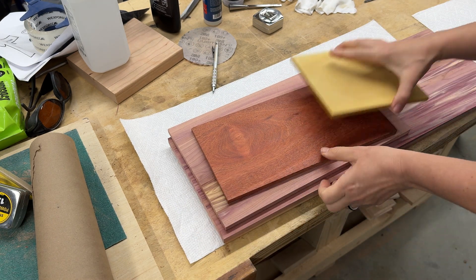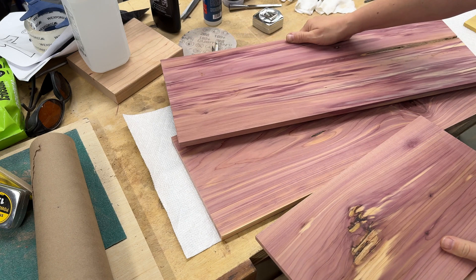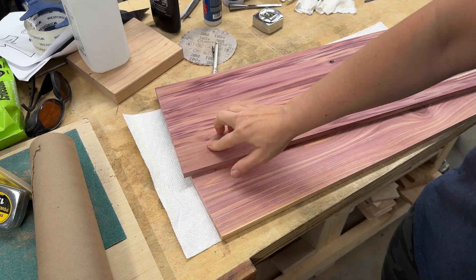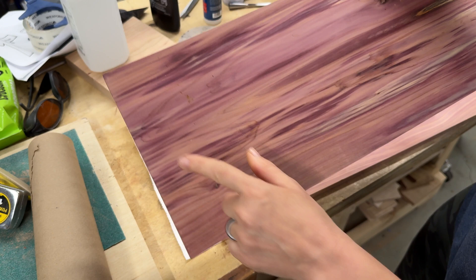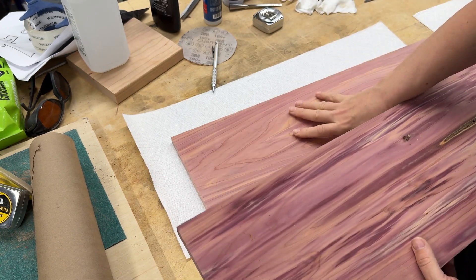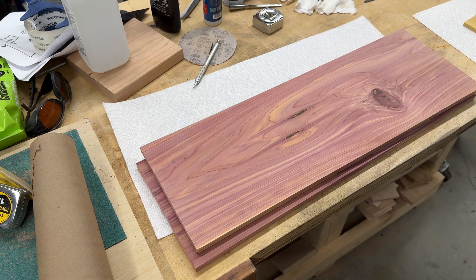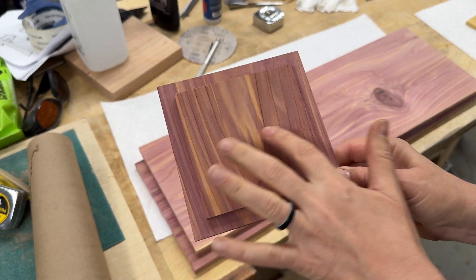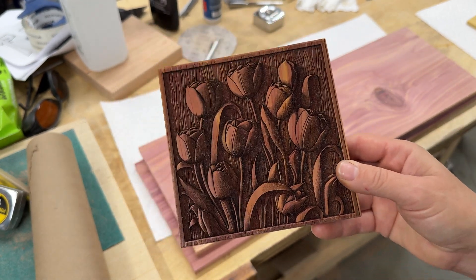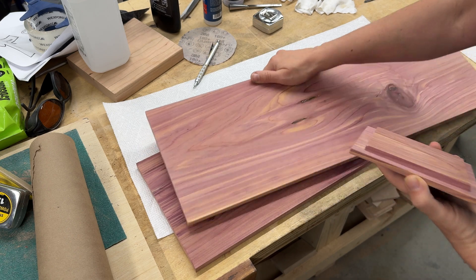When I look at my materials, I also look at grain. For example, this aromatic cedar here is not going to make a good engraving because the contrast is so high that it's going to compete with our engraving — we'll get a lot of really funny, weird results. Where this other aromatic cedar is a lot more muted, and that's what we need to get a good engraving. If you look at the back of my tulip design, it's not high contrast — very muted. So you want something that has color and some grain, but not too much. This one will make a better engraving board than that one.